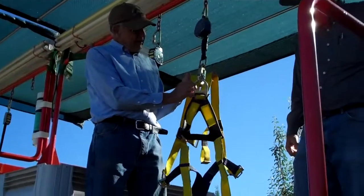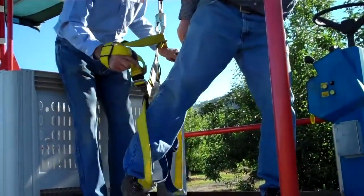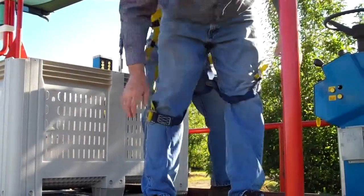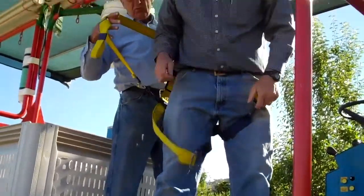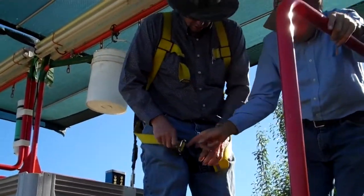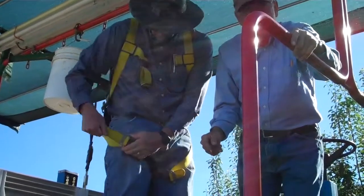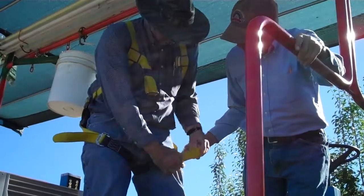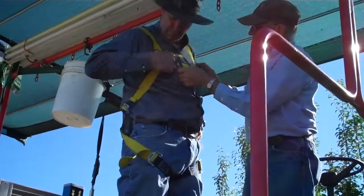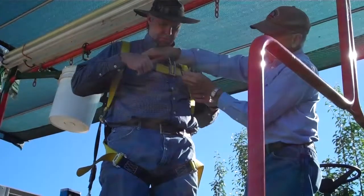The way this is done — this is the back up — so we're going to turn the harness like this. We're going to have the people put their right foot through there, lift it up a little bit, then put the left foot through the other loop. We're going to pull the shoulder straps up and put them over either side. Now we can pull the straps. To loosen it, you pull that back and you can loosen it when you take it off. Get both of the bottom straps fairly snug. Up on the top, if it's too big for you, you can pull this up to make it shorter. Then this is the buckle that goes across — it goes in like a button — and then you can pull it a little bit snug.